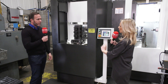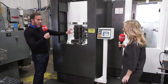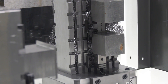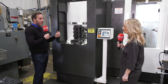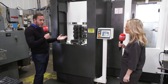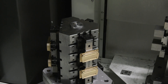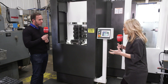Micro Lock uses fixtures that sit on tenons, which gives the whole product its accuracy. You can set one part up and simply by rotating 90 degrees, repeat the program — very easy to set up. You're locating the workpiece accurately within plus or minus 10 microns, giving the whole system a lot of flexibility. While standard products exist, this was a bespoke solution.